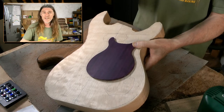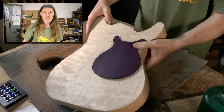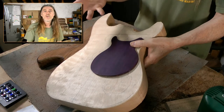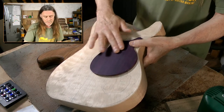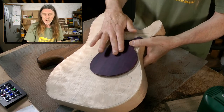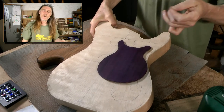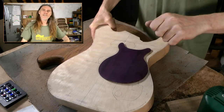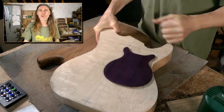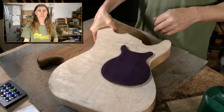and then at some point you need to sand it flat and then polish it. So if you've left any little lumps and bumps, you try and sand it flat, and then you get what we call a rub through, which is where you basically sand through the colour into the bare wood. Or even if there's no colour involved, it can still look different when you repair it. If you spray over it again, you've got this patch where you can always tell you rubbed through. So we try and avoid rub throughs like the plague.